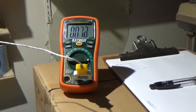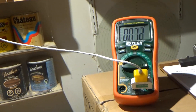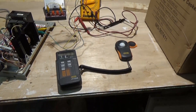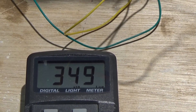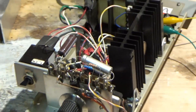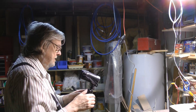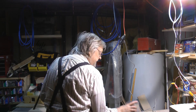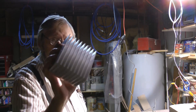You're allowed to go to 85°C without any problem with this kind of LED. It's a Bridgelux Vero 29 — I'm not sure if it's fifth or sixth generation, it's definitely not a new one. My lux reading is approximately 3,500. This is the heat sink I'm testing with the Vero 29. I can't aim the camera at the Vero because it's really bright.